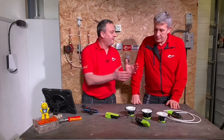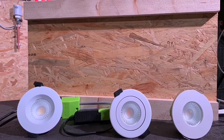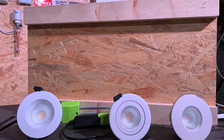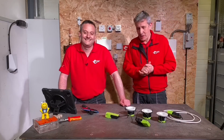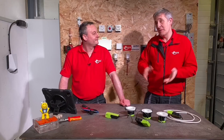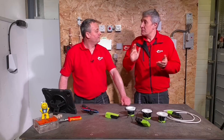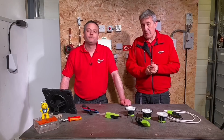The range goes up to IP65, so it can be used in areas such as bathrooms. The hot topic in the electrical industry regarding downlights is I-joists — and yes, these have been tested with I-joists, which is something you should check when fitting in new build homes. We think this is a pretty powerful package. The headline range delivers 100 lumens per watt, comes with a five-year warranty, and the stated lamp life is 25,000 hours — a nice little range well worth checking out.